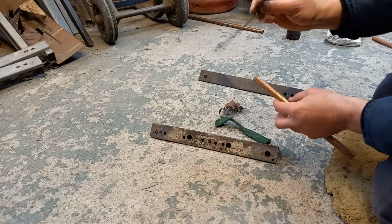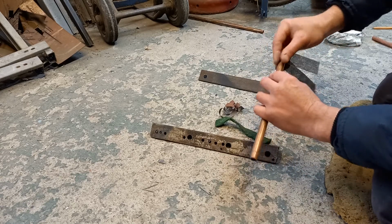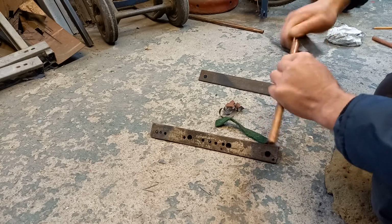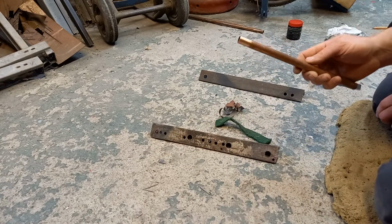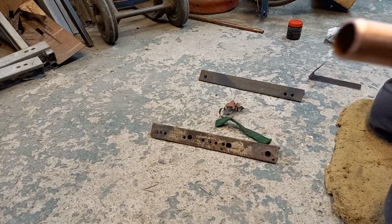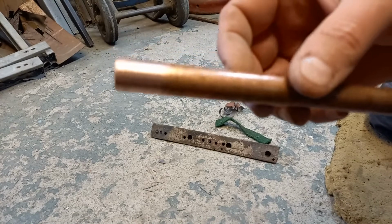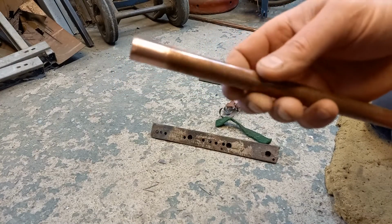Now, this is the easiest stuff to use. You can wrap it around the pipe and all sorts. So what we'll do, we'll give that a clean. And if your pipe's got paint on it, this is absolutely vital you do this, because if you've got paint on it or any dirt at all, it'll be useless. So if you can see that in the camera now, let's get the point of the camera properly. Get some focus going on here. Come on, camera, wakey. There we go. I think you'll see how clean and shiny that is. That is what you need.